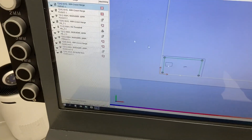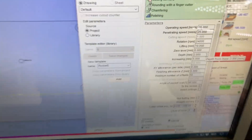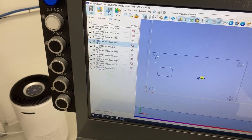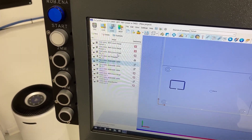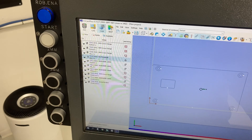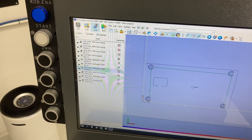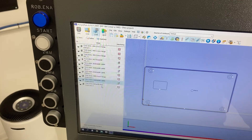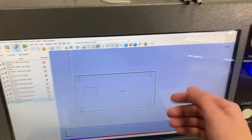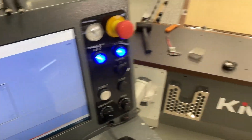Generate for current drawing — 10 stages generated. We can see it's gonna do all the holes, pocket this to a depth of two — we can check depth two, perfect. Then we're gonna chamfer that pocket, do the holes for the M6, save a tool change, thread that hole, chamfer the top of the threaded hole, countersink the screws, cut the piece out, then chamfer both the top and the bottom side using a special tool that goes down into the track.